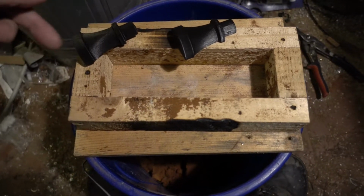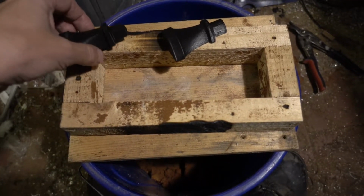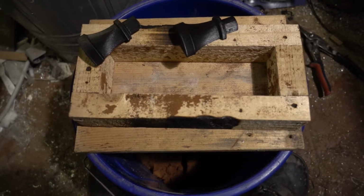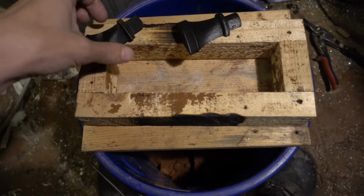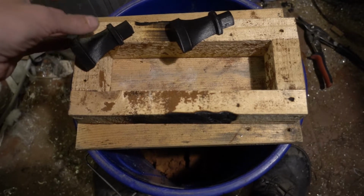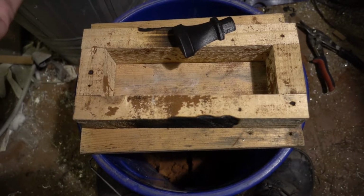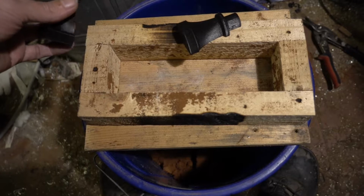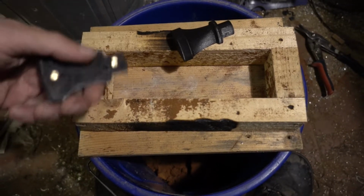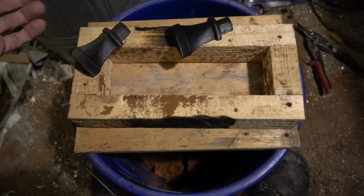With that higher aluminium content, the hardness increases and it gets a little more brittle, which is of course good, because I don't want to machine stuff that is 3 times as hard as copper and 60% more malleable as pure copper. So with 6% aluminium you get an extremely gummy stuff that is even worse to machine than pure copper. So you don't want to machine that. You want to shoot for something between 10 and 12% to get a good machinable result. So I will just mix that. I will make a mold with oil sand, and then yeah, just mix that stuff up and cast it.